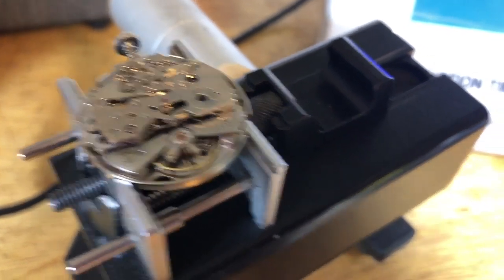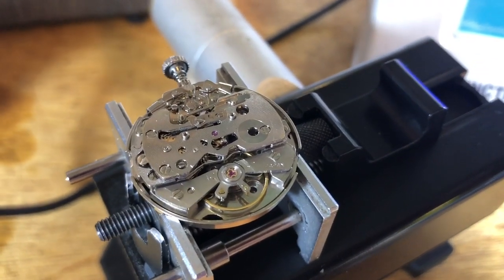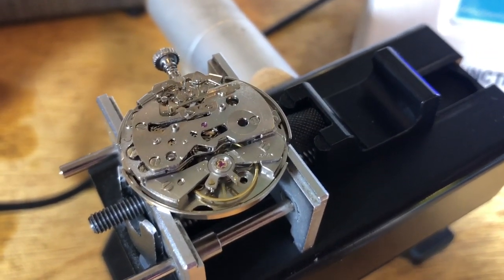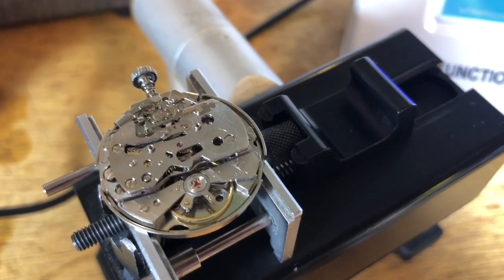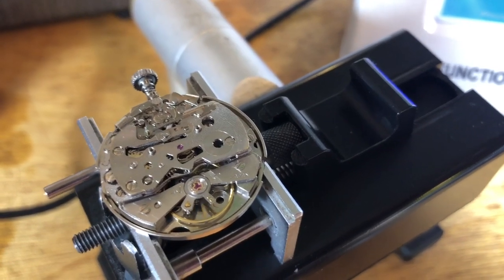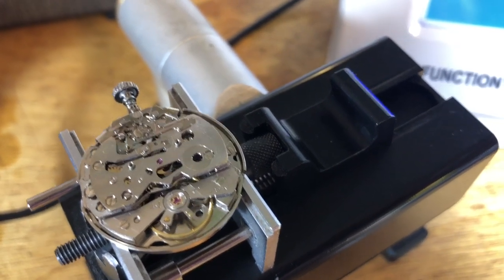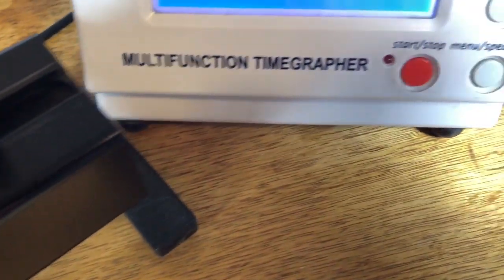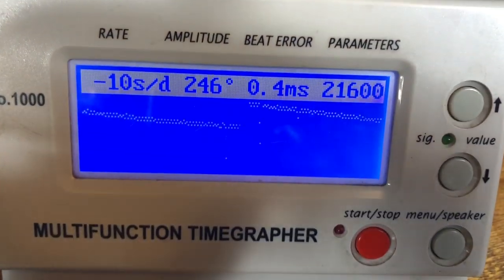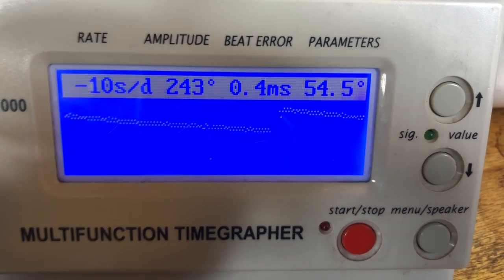So I tried an experiment, actually, that I'll tell you about in a little bit, but I'm working on trying to save the original chronograph wheel. It just broke my heart to have to replace something that was functionally 100%. So I did some really fine detail work to see if I can seat that sweep hand down a little deeper and get it to grip. So we're going to try that because I just didn't want to swap that out if I didn't have to. We're still in adjustment on this. It's still just running in. I haven't started it. It wasn't too long ago.